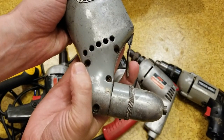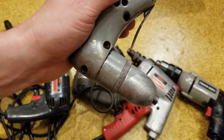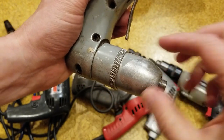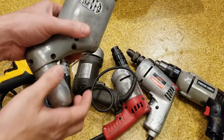It's a really underpowered 1.4 amp motor. This one isn't so bad to adjust, but it's still kind of bad because you actually have to unscrew the collar and then use a wrench inside while holding the anvil to adjust the torque. It's kind of funny because you have to open up the tool every time you want to adjust it. But once you get it adjusted, it's pretty good.